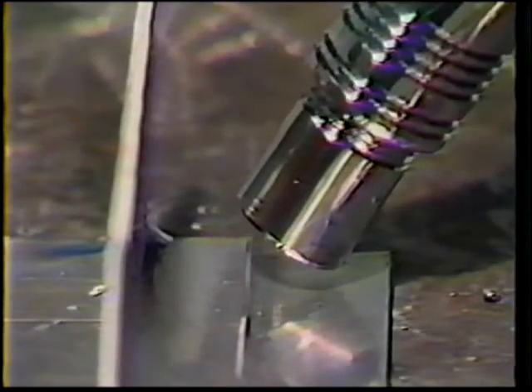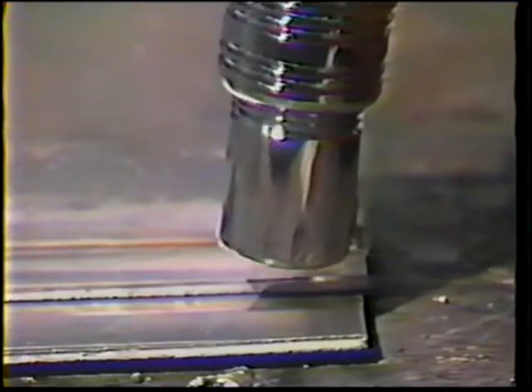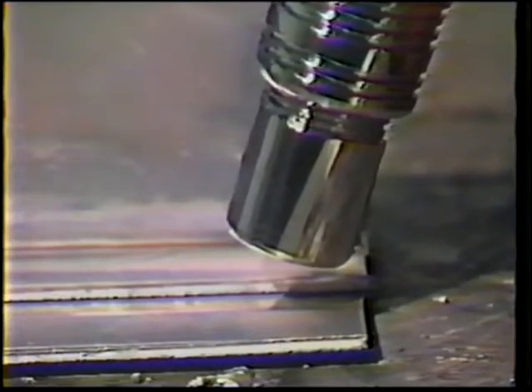Place the workpiece in a horizontal position that allows free movement for welding. For the lap joint, a 45-degree work angle and a 20 to 30-degree push travel angle will be used. Start the arc and move quickly along the root of the joint with a smooth, steady motion without hesitating or moving too slowly. The proper travel speed will keep the electrode wire slightly ahead of the center of the puddle.